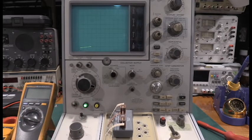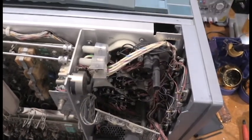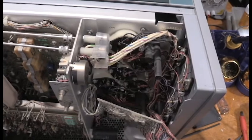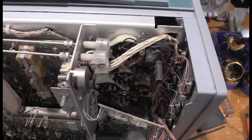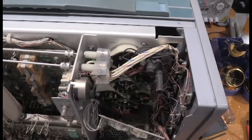What I'm going to do is power this back down, hit these switches with some more alcohol, let them exercise, then wait about an hour for the alcohol to flash off. At this point, the three major issues that usually kill one of these — we've gotten through those. So everything at this point should be repairable. I was troubleshooting the power supply yesterday on the 576 and found out the variable 4.5 volt rail and the 5 volt rail were low. Did a ripple check with a scope — it ripples pretty bad on that one. I'm suspecting the bulk filter capacitor is not working.